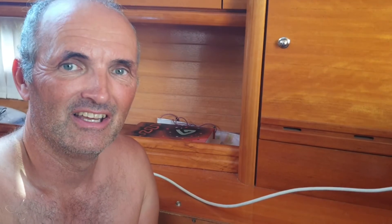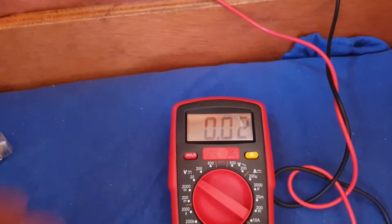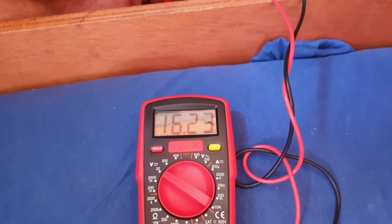The next test is to disconnect the shore power so that we're running completely on batteries and the solar system, and see what we're getting. I'm testing the voltage on the batteries which is currently 13.5 volts — terrific. The voltage coming out of the panels under load is 16.2 volts — also terrific. The solar voltage is greater than the battery voltage so the solar panels should keep the batteries charged. We're going to stay off shore power for the rest of the afternoon — about 2 p.m. We'll run the 240-volt fan off the inverter, we've got the fridge going, and we might plug in a laptop to see how the panels cope. This is a great step forward — it means we can leave the marina once more.